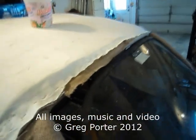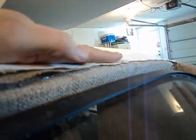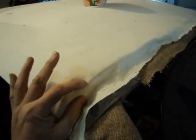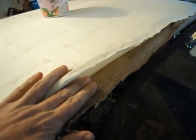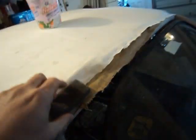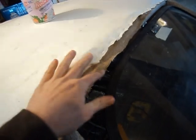Starting today looking at the back here — I just removed the staples from this side. You can see the foam was laying almost flat with the bow, and at the corners there's a bunch of overlap and foam thickness. I took out the staples and stretched this burlap so it would be more taut on the bottom side, pushing the foam up. I want a consistent thickness of foam all the way across rather than thick foam here and thin foam there, which would create a line. I want this top to be as smooth as possible, especially where it's coming over the bow.